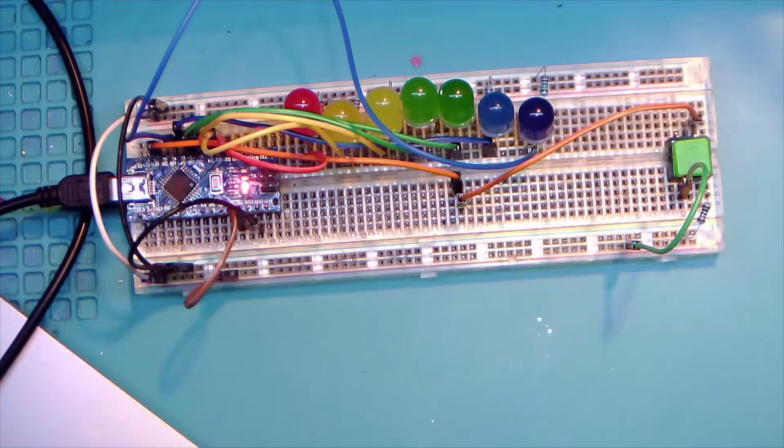And so now we can take LED_BUILTIN and be lazy and copy and paste. I always prefer, if possible, copying and pasting variable names because that way you don't mess them up. So now instead of using the built-in LED, everywhere that says LED_BUILTIN, we're just going to click in and say TEST_LED. And then you guys are going to hit upload, but that's going to give me an error. So let me do this one more time.